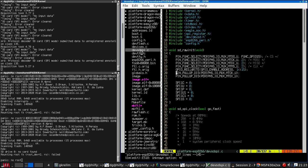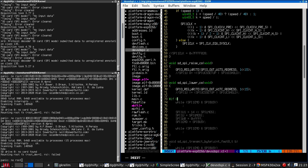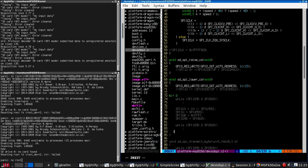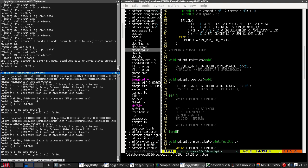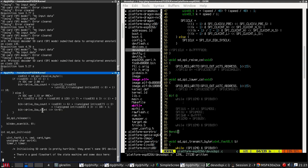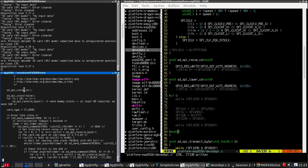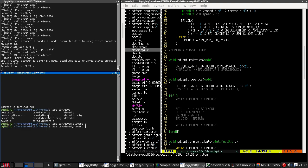Well, I do not like this piece of code. I know it was appearing in the MSP430, but I can't actually find a reference to it in the spec. And if I look at the actual initialization code in the Fuzix source, we can see here, so we raise CS, we switch to slow mode, we send 160 clocks, we then send command 0, and if you look at what command 0 does,